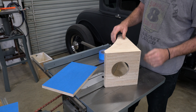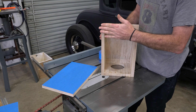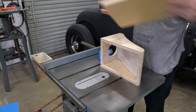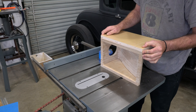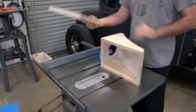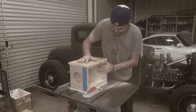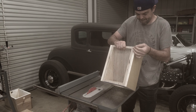This is either a really good idea or a really bad idea, but I had some alignment problems with my laminates and as a result I don't have a perfectly flat surface for my glue-up. So what I'd like to do is run this thing through the table saw just to get a perfectly clean surface. I'm going to blue tape both surfaces and glue these together so I have something to run against the fence on my table saw to get this thing perfectly flat. If I screw up, I probably screw up the whole piece. If it works, I'm good. I should mention that I also used the fence of my table saw as a square guide to glue these temporary pieces onto the part, to make sure the tops of these temporary pieces were square to one another. It sounds confusing but it's actually pretty simple, and it worked.